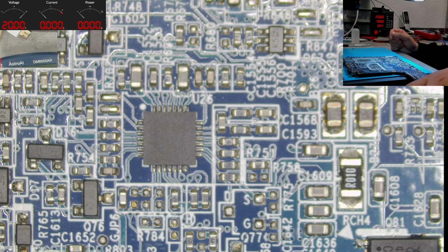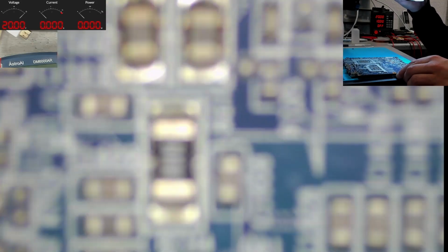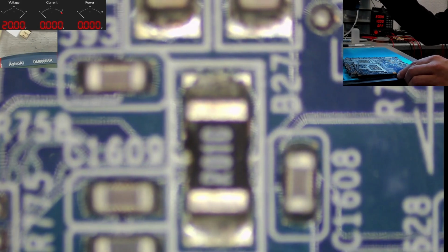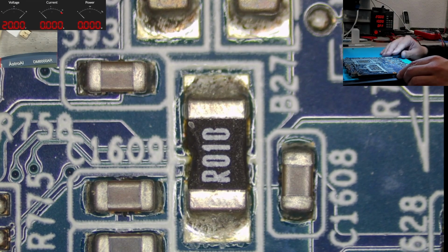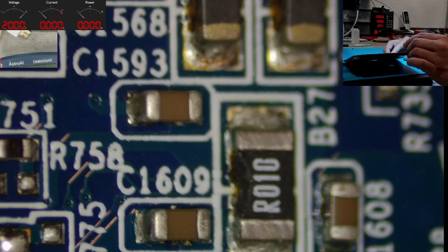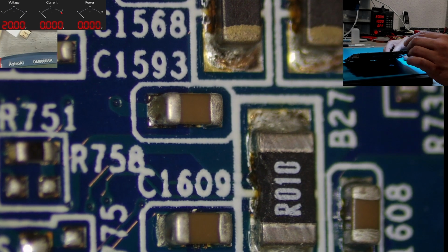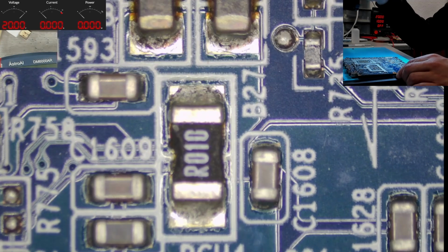And now I'm here checking the charging controller and the surrounding circuit. Can you spot the same thing I can spot already? Let's have a closer look. Here. What is that? Does this look like a nice current sense resistor? What do you think? Looks like someone was hungry. Looks awful. I want to replace it.